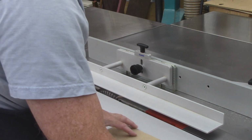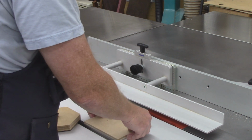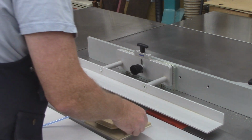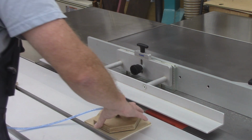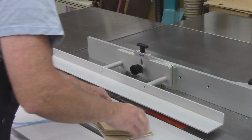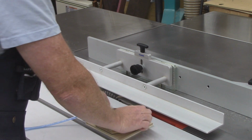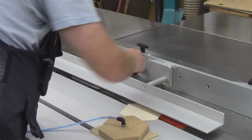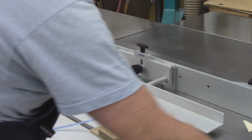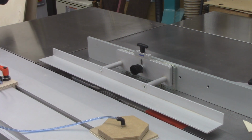Try to put the Baltic birch under this and see if I can actually move this thing. Put the Baltic birch ply under the MDF. The Baltic birch bows a little bit, but once you press down on it, it seems to stick. And I've got 22 inches of vacuum, so let's give this thing a whirl. Let's see if I can get this out of here. I guess another option might be to put plastic under it or apply a sealer coat on the MDF to try to seal that up.